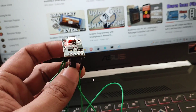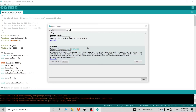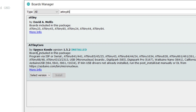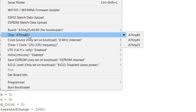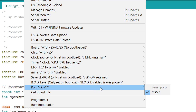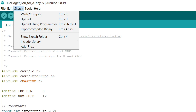After connecting the SPI pins, go to the Arduino IDE. First, download the ATtiny board package — make sure the board package is from Spence, because the package from David is not able to play the buzzer sound. Then download the code from my GitHub. Select the board with no bootloader, select chip ATtiny85, select clock speed 8 MHz internal, select the correct port, and hit upload bootloader. This only sets the fuse bits, it does not upload any bootloader. Now click on Sketch and upload using programmer.